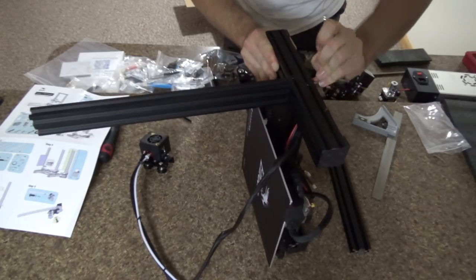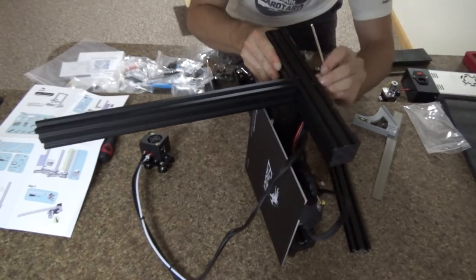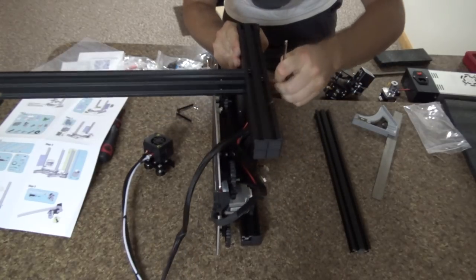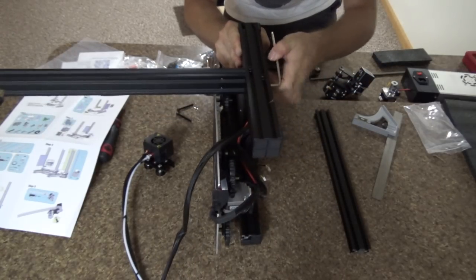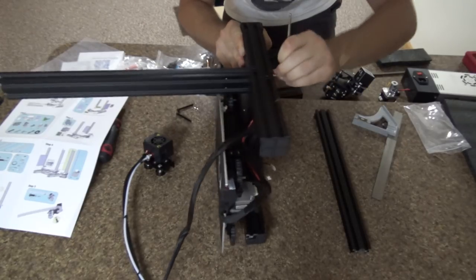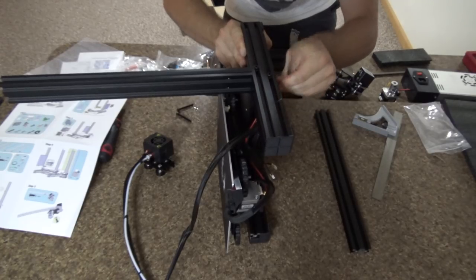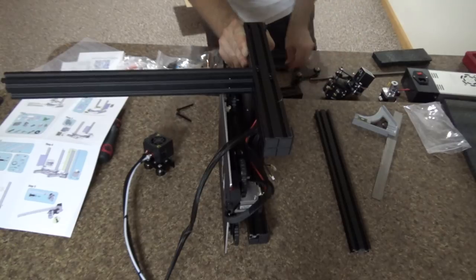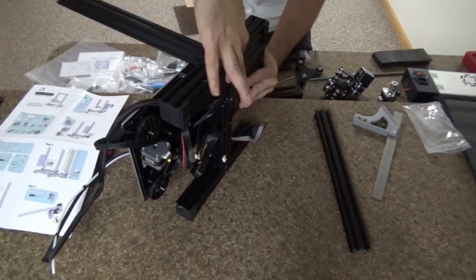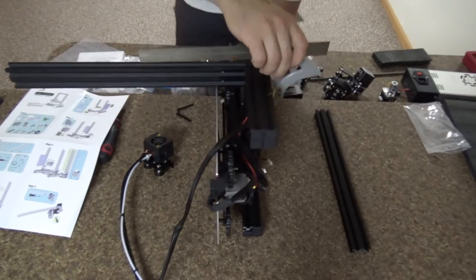Now you are going into aluminum, so you don't want to tighten it too much. But I want to make sure it's tight enough that the screws are recessed into the bottom. I don't know if you can see it too well. Okay, that one's as tight as I'm going to go. And this one's as tight as I'm going to go. You want to make sure that this bottom surface is flat and the screws aren't sticking out, which they aren't. They're pretty much flush.